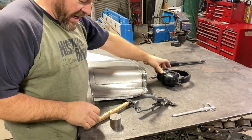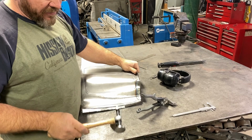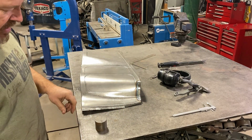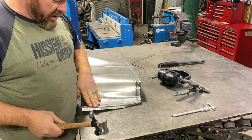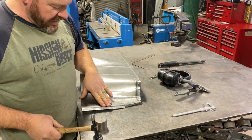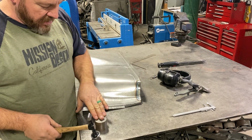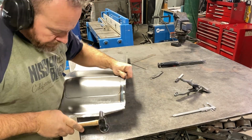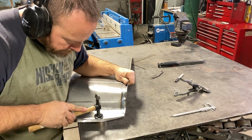So it's a curved line. I have all sorts of different pieces of solids and whatever, and I try and put it above the lid on the table so you get good angle action, but it's a curved line, so I'm going to use this curved dolly because this is a straight edge to be able to correct that line.